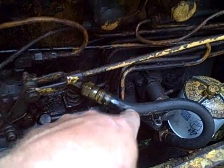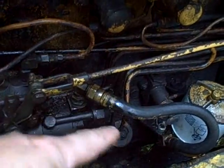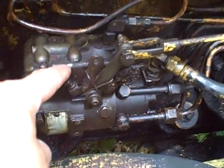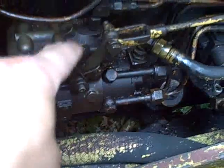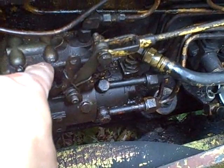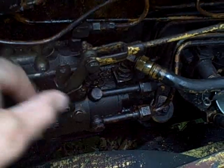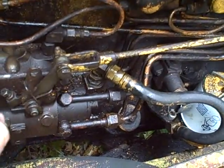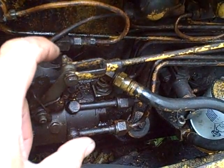One of my other theories, if this is getting good fuel in here — and I already checked the screen in here and that's good — one of my theories is that it could have something to do with the governor that's internal to this pump. Right inside this top box assembly there's a cover you can take off, and inside is the governor mechanism. When you move the throttle lever open and closed, a small metering valve inside is allowed to open and close.